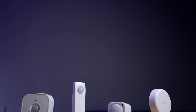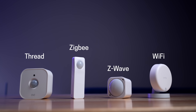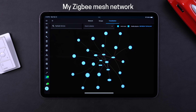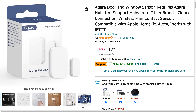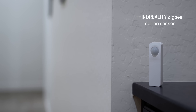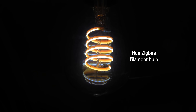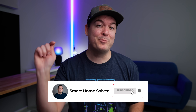The other thing to consider when picking a smart home system is what kind of sensors and devices you want to use. There are Thread, Zigbee, Z-Wave, and Wi-Fi to choose from. Wi-Fi is self-explanatory, but the other three are their own protocols that build out mesh networks to expand across your house without clogging up your Wi-Fi bandwidth. Thread is still fairly new, so you might run into more issues than something like Zigbee, and Thread devices often cost more. The majority of devices in my house are Zigbee — it gives the widest selection, lots of inexpensive options, and it's been very reliable.